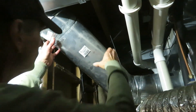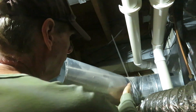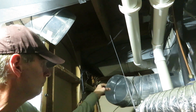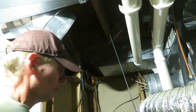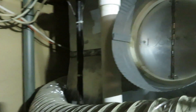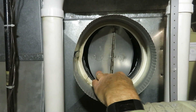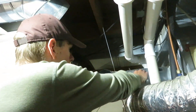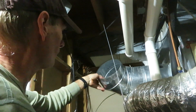I'm going to take a moment to show you the damper at the plenum, which is another important component. I just have to take a couple of pieces of pipe off. The damper is custom made — I couldn't find anything that would fit this system quite right. When the collector comes on and starts providing heat it blows the damper open, and when it's off a spring pulls it back, keeping the furnace heat in the furnace. From there the solar heat is distributed throughout the house using the existing furnace heat ducts.